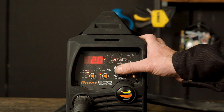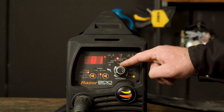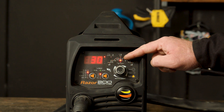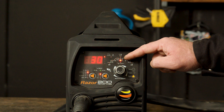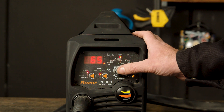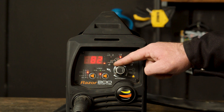Part 4 — Peak amperage. Peak amps are the set value of amperage the machine will deliver during the peak amp period of the cycle. The smaller the gap between the peak amps and the base amps creates a hotter weld suitable for thicker materials, and the bigger the gap between the peak amps and the base amps, the cooler the weld, suitable for thinner materials. Part 6 — AC Hertz. If you turn it up, it will increase the cycle speed, making it a thinner weld in appearance since the arc is more focused. And if you turn it down, the cycle will decrease speed, making it a thicker weld in appearance since the arc is more widespread.